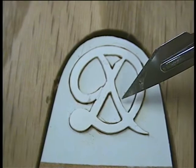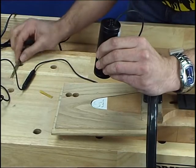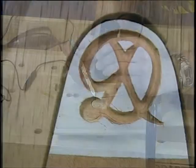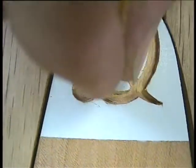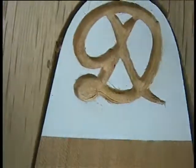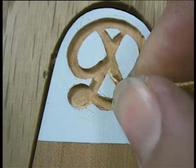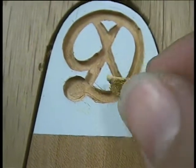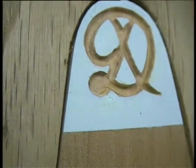It's just a little bit tight, so I'm going to use a little piece of sandpaper to sand that out — just going around and sanding off along where the router's been. You get some irregularities; just give a nice smooth edge so that when you put the pearl in it looks neat and tidy. And if you slightly over-cut it, if it's neat it doesn't bring attention to the cut.